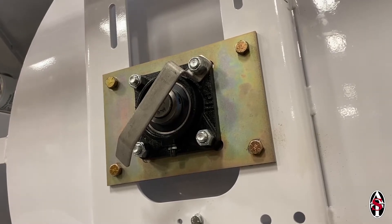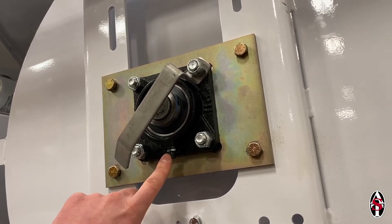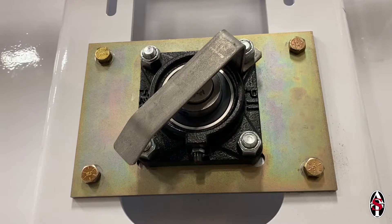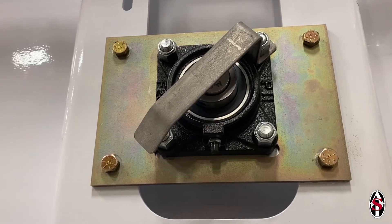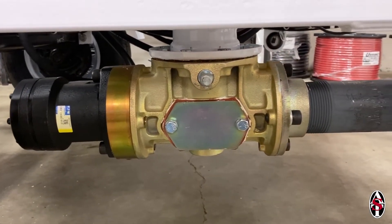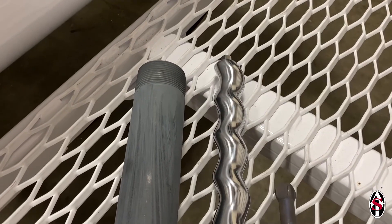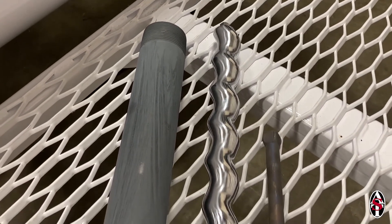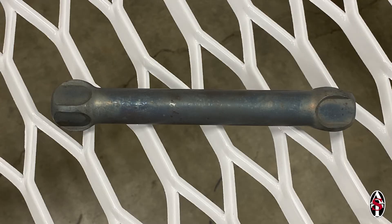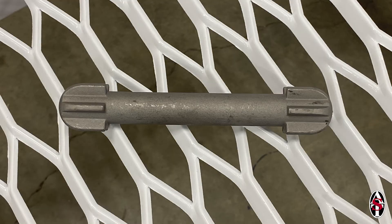To keep the tank shaft spinning smoothly, grease the bearing on the side of the tank. The timeline for greasing depends on your use of the machine, but a good rule of thumb is every six months. Another key component is your pump. You should inspect pump parts such as the connecting rod, rotor, and stator tube regularly about every few hundred hours. Typically, these parts need replacing every three hundred hours for square drive systems and every one thousand hours for star drive systems.